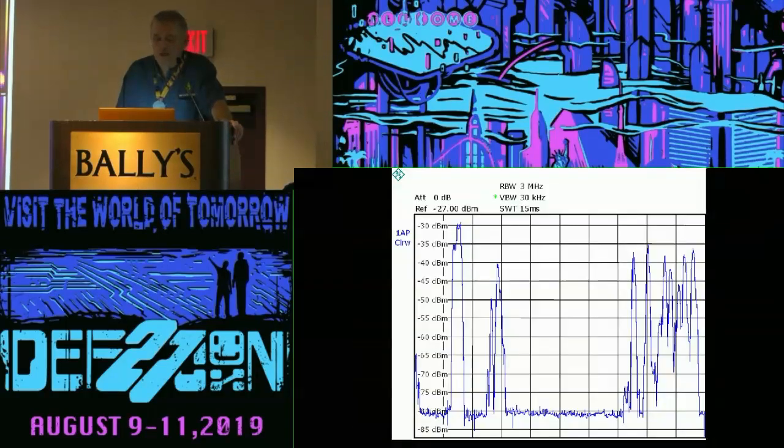Well, your problem is this. Looking on a spectrum analyzer from basically the AM broadcast band to one gigahertz, you see all these monster signals. Added up together, they are enough to make most software defined radios quit working. You have a first little transistor right there coming off the antenna, and if you hit that with enough signal, it goes nonlinear — it stops working. This is an effect I'd describe as wearing a hearing aid to a rock concert. It just stops amplifying properly and you're no longer getting proper signals.